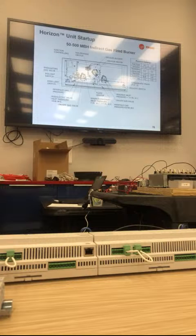The igniter's off center. What we're finding is that the sheet metal our manufacturer uses has tolerances that are off. It shifted everything. When we test it here, with 70-degree plant air, there's no problem. When it's 0 degrees or 20 degrees outside and your density increases, you have a whole other situation that they don't see. When you're up there looking at it, they seem to be sitting on the far left side of the burner. Those are being moved, and we're going to show you how to move the flame sense and a quick fix for the igniter itself.